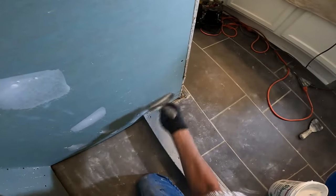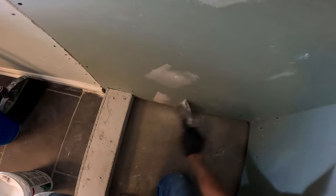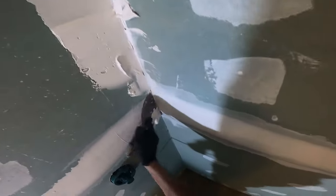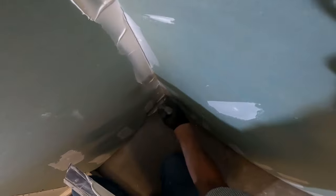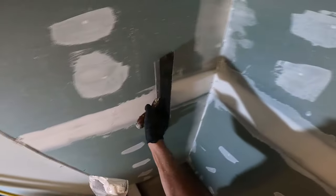The puncturing of the curb material — the pan liner — you saw where I screwed in all my backer board into that curb, and yes, I am puncturing into the pan liner I wrapped it around. Seems counterintuitive if you're relying solely on the curb itself to be your waterproofer, but I'm not. By buttering the entirety of the curb and making it like one monolithic piece, then waterproofing it, I don't have to worry about the curb ever seeing water. Plus, it can't wick water because the inside of the curb is also raised by that one inch I was talking about on the other three walls. Water can't get within because I'm waterproofing it, and it can't get without — meaning into the adjoining studs — because I'm waterproofing it.